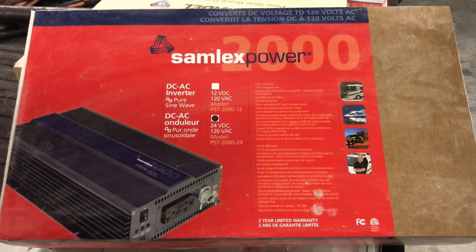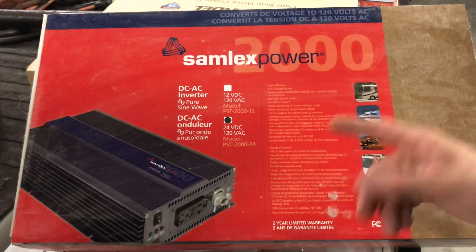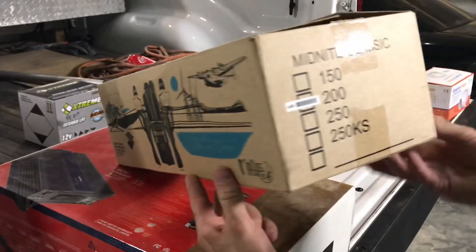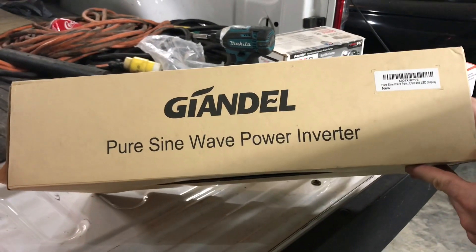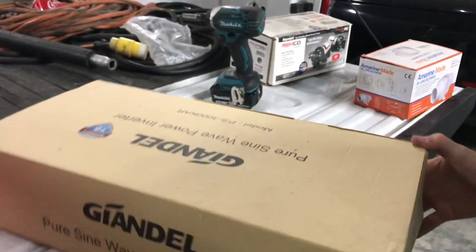We'll list the model numbers in the description. I found some Amish guys doing solar, talked to them, and figured out what they were using — I know they use stuff that's good and affordable, and that's how I came up with our setup. This is the 2,000-watt inverter, the original one, and it's worked really well — but you can get the same brand in 3,000-watt, which I'd advise for this size system. This is the Midnight Classic charge controller, the 200 series. And this is the other inverter — the 3,000 to 6,000-watt — which we ordered off Amazon and it's done pretty good.